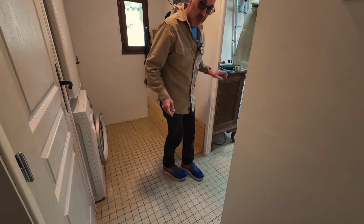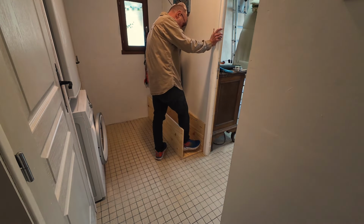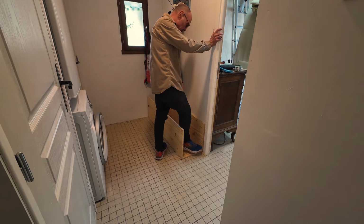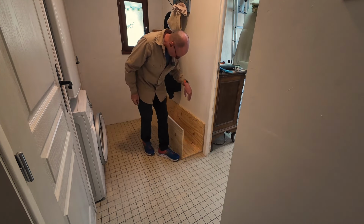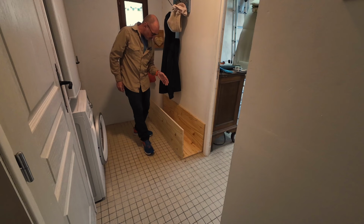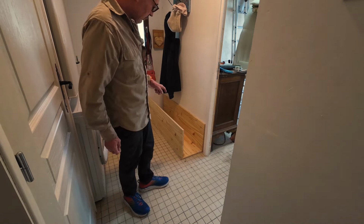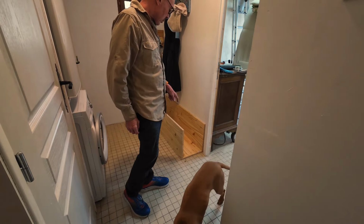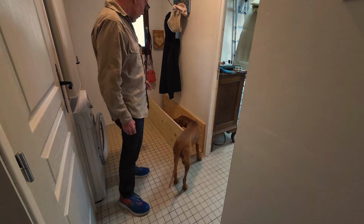And because I have really big feet for such a small guy, I can't get my trainers in that way. This is 300mm timber on the bottom, so I'm going to make it so our trainers stand up edgewise. So I'm going to put some compartments in so they all don't fall over. I want to cut two ends and probably 3 compartments. 400 minus 18, so they want to be 382mm long, and I need 5.